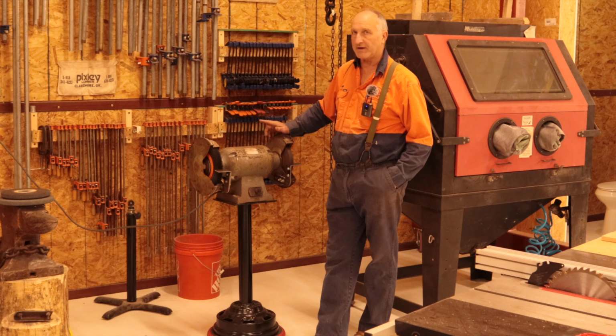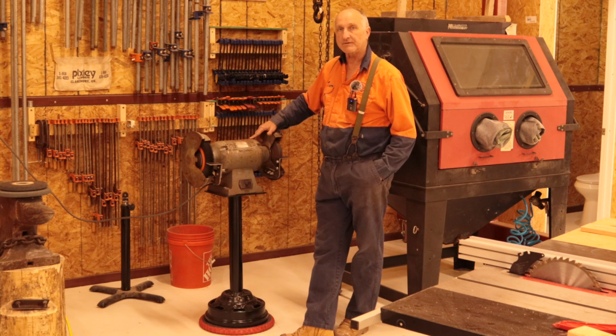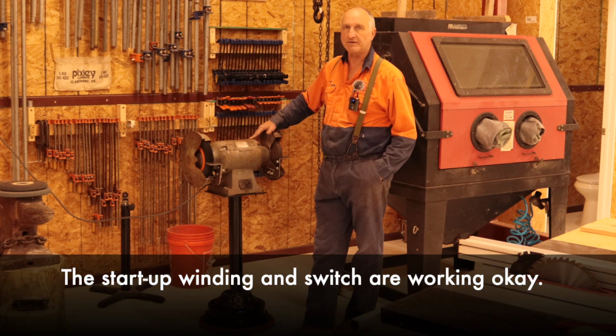I've got 20 amp circuits in this shop, 12-3 wiring. I mean, it's rated. But the motor, by the nameplate, says 15 amps. But the inrush current on this must be enormous. Even after I changed the capacitor, if I started it once, it would start once, let it slow down and stop, tried to start it again, pop the breaker. Routinely, every time. What are you going to do with that?